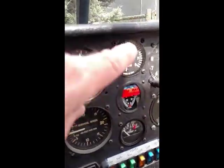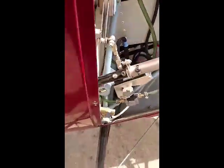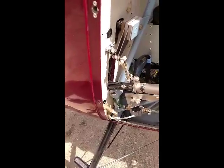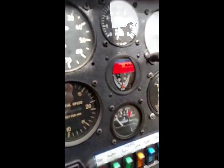and it downlocks the collective. The other thing we have is a fuel flow meter with an associated gauge on the dash, and I put that in instead of manifold pressure to help the pilot determine his power settings. This is an altitude compensator for the carburetors with a needle valve, again accessible to the pilot right here. You can lean out the mixture at altitude to maintain optimum power by adjusting for peak EGT, exhaust gas temperature.